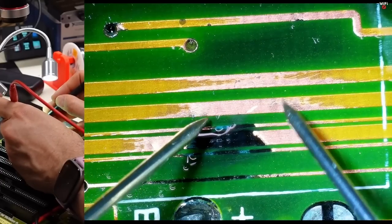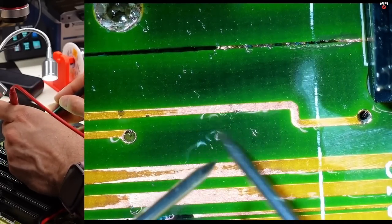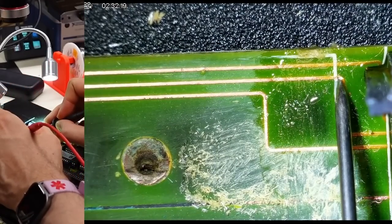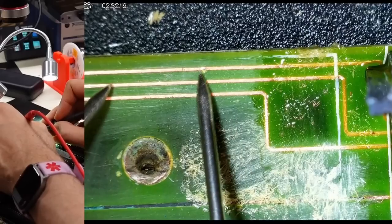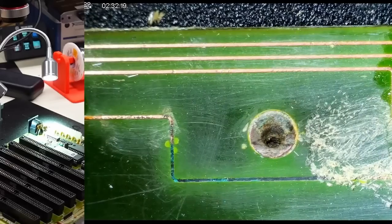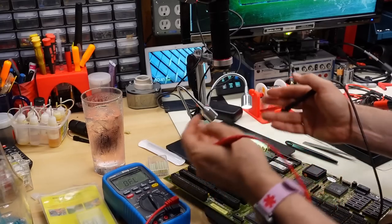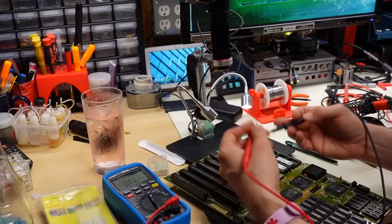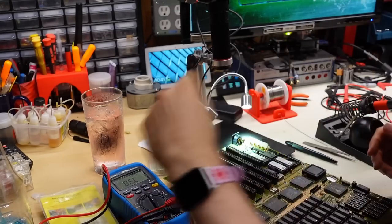If we had schematics for this board, it would make fixing it a lot easier — anytime traces were hidden underneath things, we could just find out where they were going by tracing them back to the chips they were coming from. But we don't have that luxury, so we have to do it the old-fashioned way by just using our eyes. It's time to do some soldering. The alcohol is still spreading out from under the keyboard connector, so I'm going to grab the hot air at 150°C to dry that out. I want to use some flux on this area, so it's a good idea to get rid of the alcohol first.